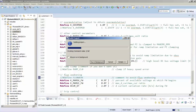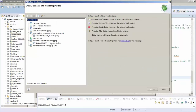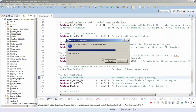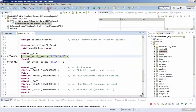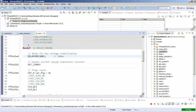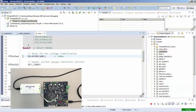Finally, run the debugger to program the software into the flash of the microcontroller. During this process, you can check the status of the LED on the E1 debugger. When it's finished, you can remove the E1 debugger.